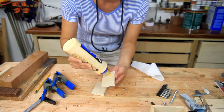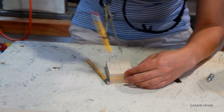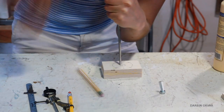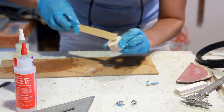Now we have the knob. Glue the two small pieces, cut G, together. Then create a knob — I used angle bisecting. I drew the bolt head on the knob, chiseled out enough space to fit it in, then cut out the shape on the bandsaw. Next I epoxied in the bolt head and let it set up.